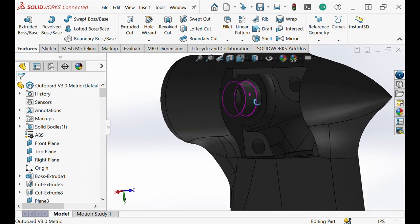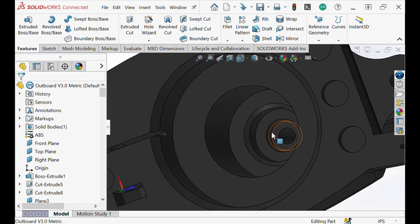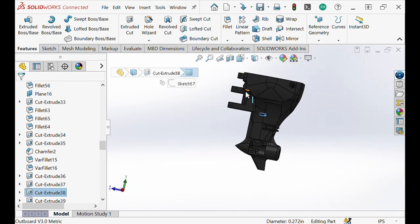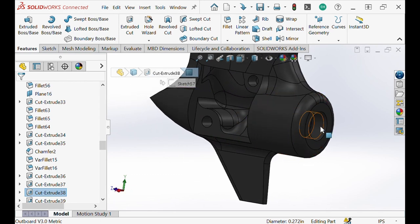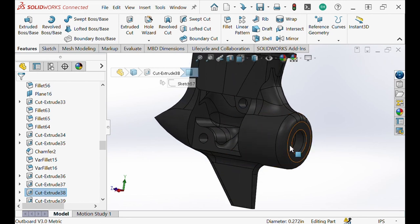We've got a lot of precise locations — bearing holes. The bearing goes in here, there's another identical one down here for another bearing that supports our vertical shaft. We've got another two holes: one for another bearing and one in the back for the horizontal shaft. Those are pretty tight tolerance. When you install these, you're going to want clean bores, and I'm going to show you how to get that.